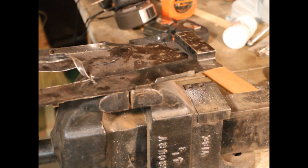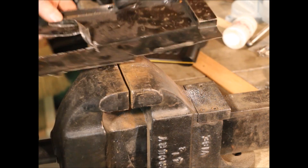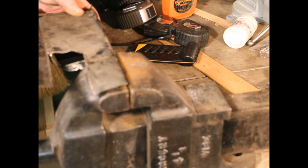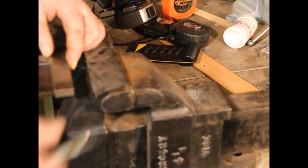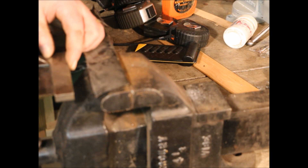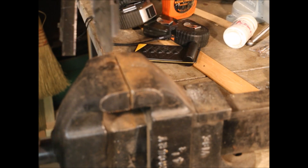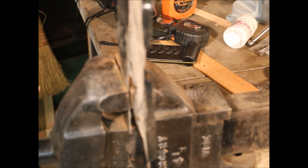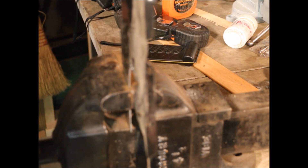I'm going to scribe another line, 90 degrees to the original. Just so I don't cut my fingers, I'm going to stick the piece of metal in the vise so it'll hold it securely. With the edge of the square snugly up against the piece of material, using that straight edge I just established by cutting along the top of the vise, I have another line. Then I set the part in the vise, set that line on top of the jaw, snug it up, wiggle it around until it's square, and I cut it again.